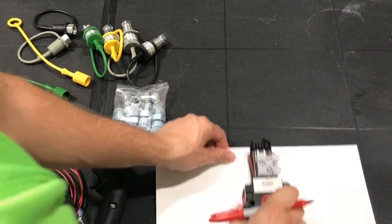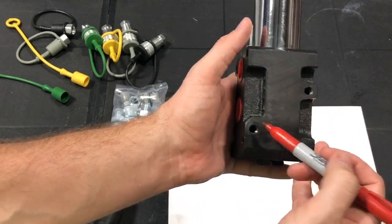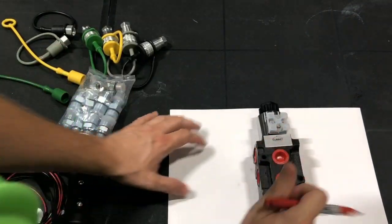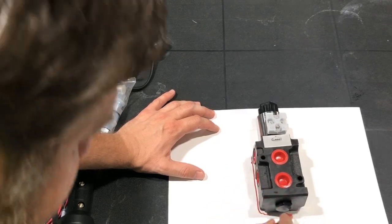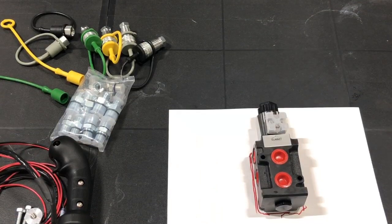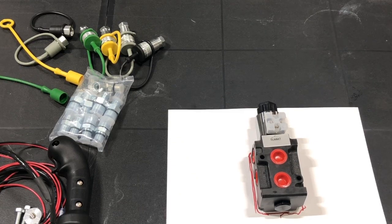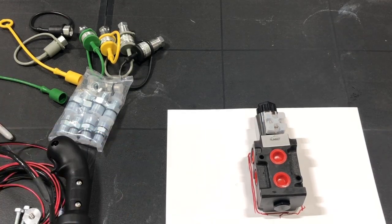So the back side of this hydraulic diverter, actually these 2 ports are threaded, so that's going to be the side that obviously mounts against the inside of the FEL bracket. My plan now is just to trace this loosely so I get an idea of where it's going to fit on the inside of the FEL, and then I'll cut this little template out and mark the holes from the back side so I know where my drill points are. This doesn't have to be exact, it's just so that you can get a center point. When you look inside of that FEL, you can see that there's a support area in the middle. So you're going to have to center this perfectly, or else you're going to be drilling through a lot of material. So that's the idea for tracing it out and getting those hole patterns.